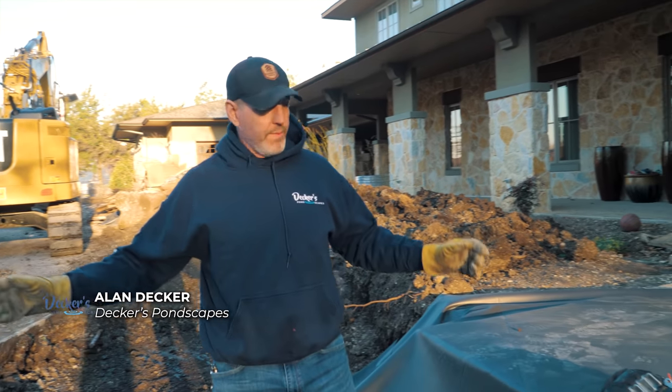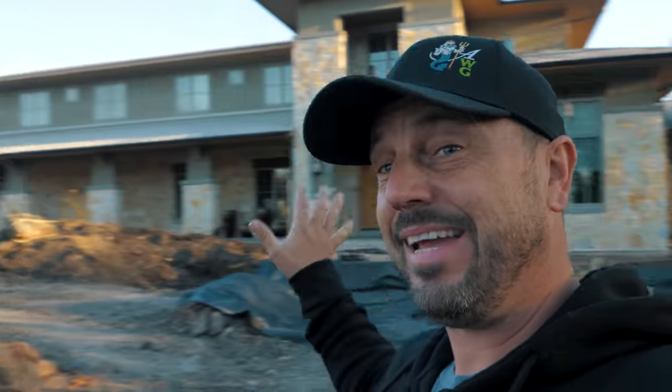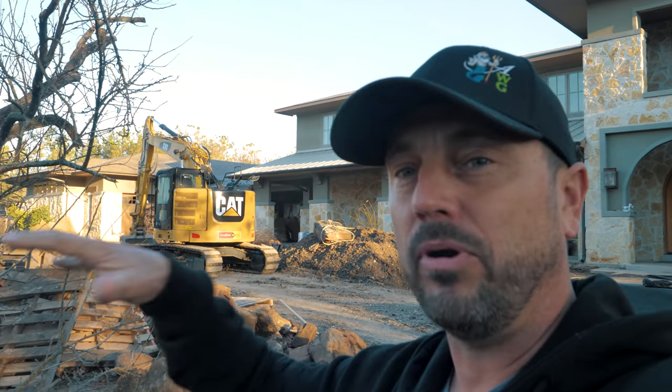There was a piece of concrete in here that we ripped out — this is the existing pad. We've got to go from this elevation out to the driveway elevation, but there's going to be a bridge here. We'll have to peel the liner back and over-excavate a little bit so we can get some gravel and blocks in there so the bridge can sit nice and perfect. The homeowner Matt is actually making the bridge out of eight-by-eight timbers that were behind the barn — it'll be cool to repurpose material that was originally part of the house. We'll mix stone and wood where you transfer into the house, and flank it with boulders so you don't see any of the block work that holds the bridge structure up.